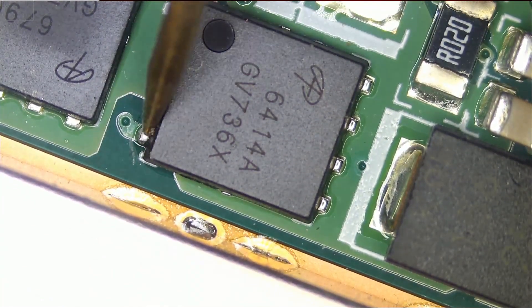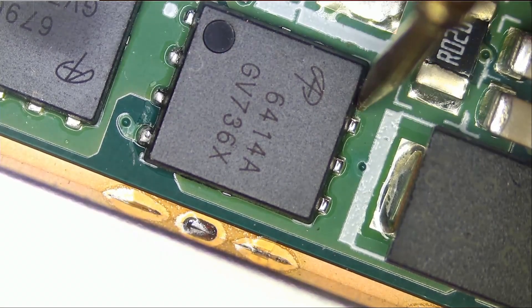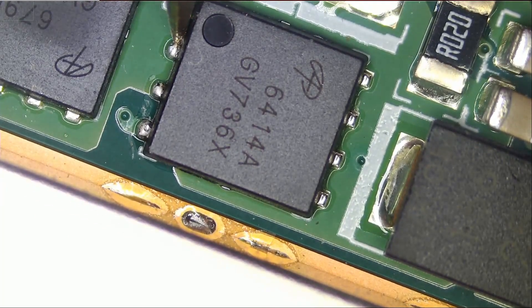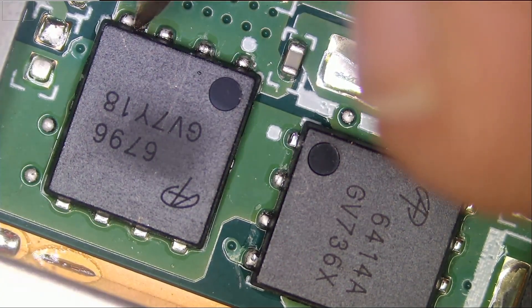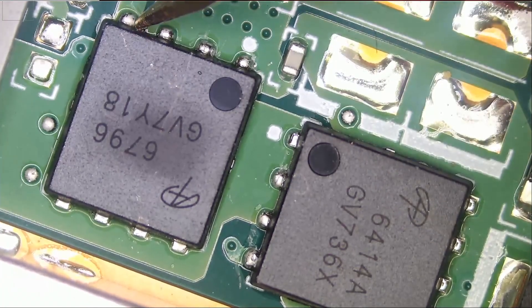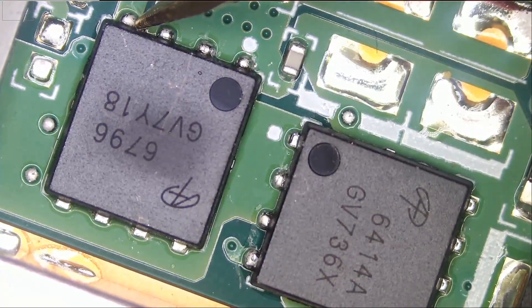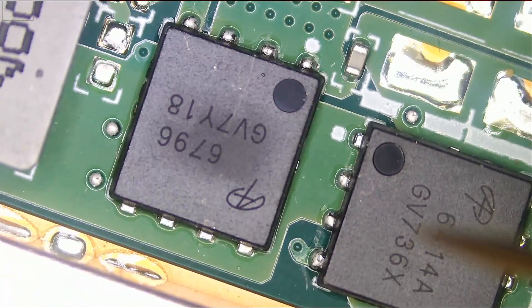Measuring the gate here — I'm getting 7 volts, 5 volts here, and 3.5 volts here. What about this one? 1.5 volts — that's very low. If we do not have the proper voltage at the gate, the chip itself is not going to work; it's not going to be able to pass voltage. A MOSFET acts like a switch — look up the video where we explain what a MOSFET is and how it works. So what do we have here? Zero volts. And at the other end of the MOSFET? 3.5 volts.